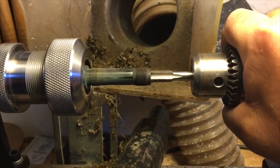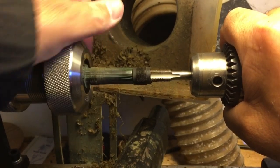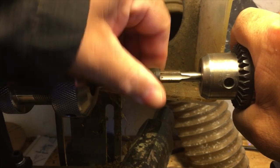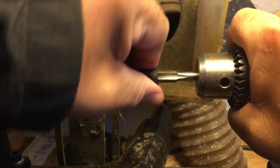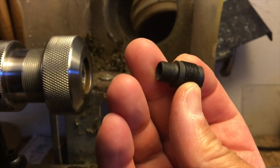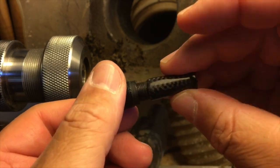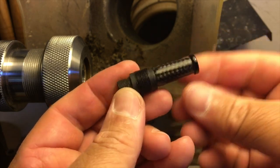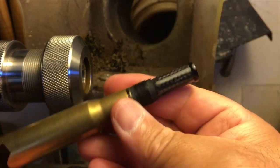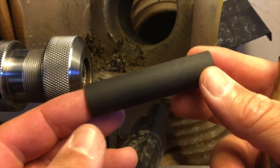I'm using a 10 by 0.75 to cut those threads on the inside. You can see that's spinning on me — unfortunately I think I smoked those threads, so I'm just going to try and keep it lined up and feed it by my fingers. That's threaded on the inside — kind of hard to see, but it's in there. It's threaded bottom side and inside. To test that out, I have a section that I made for a different pen — same setup. I haven't made this section yet, but you get the basic idea. We'll screw that in — and there we go. Next video, we'll just make the cap. We'll see you there.